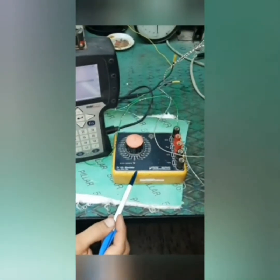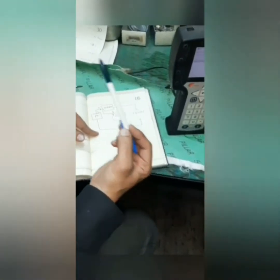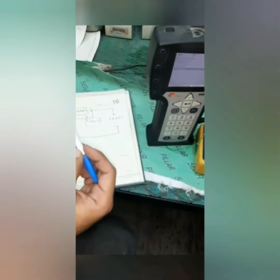Now we see the HART is operated. Login to the device — pressure transmitter. We see its process variable. It shows the applied process value, lower range value (LRV), and upper range value (URV) on the screen of the HART device.